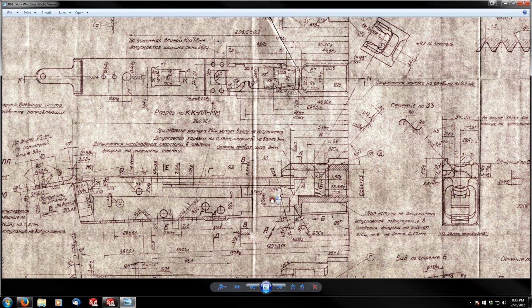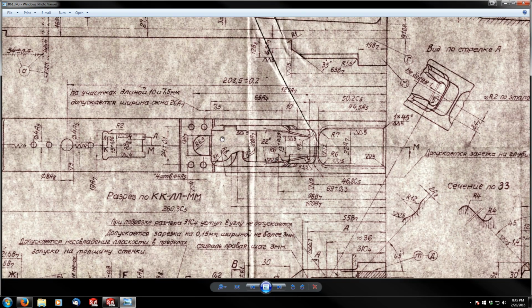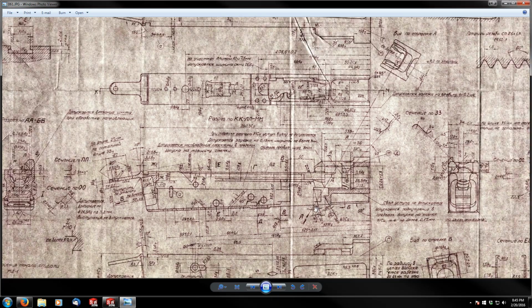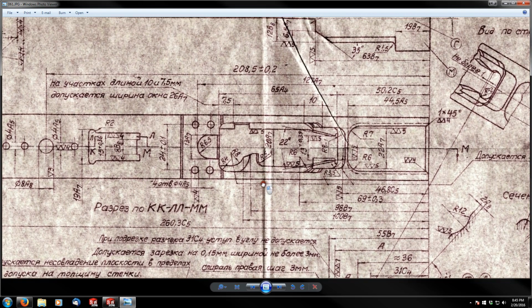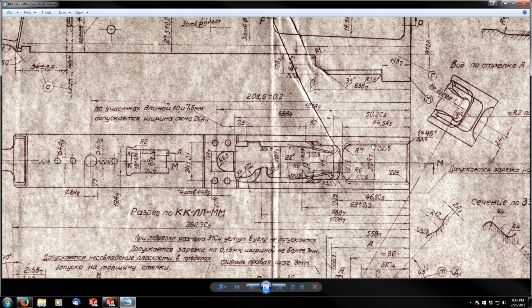And the primary views I'm going to be looking at for information are this one and this one. This one's going to give me the angles that I'm looking for while I'm making my lofted cut, and this one is going to tell me the information relative to laying out the profile of the magazine well. So let me go ahead and throw that over on my other screen.